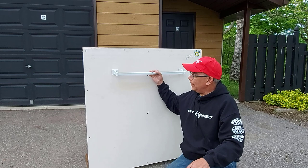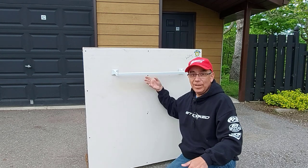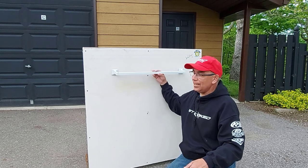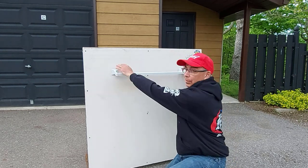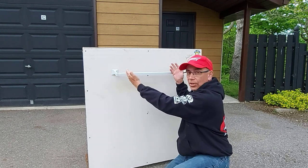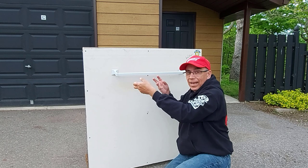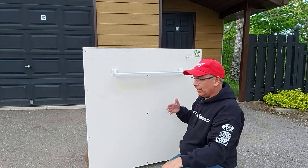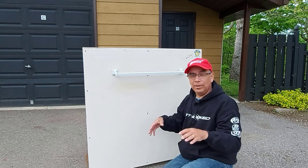You put wet towels on it, it's heavy, maybe you pull on the towel and every little tug it starts to pull out. Maybe you have young kids at home that pull on it and it just comes loose. What happens is those plastic wall plugs, drywall plugs, they start to move out of the wall and the screws back out of the plugs — it's only plastic, so that's what happens.